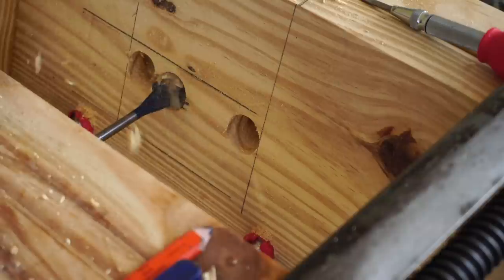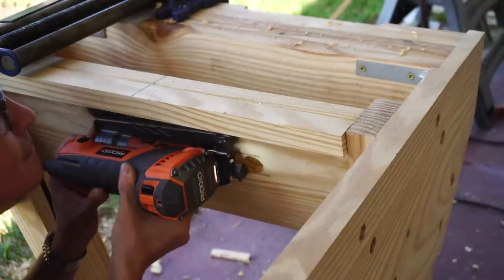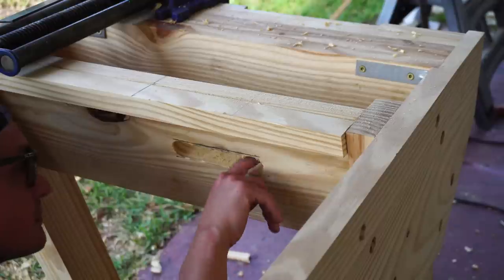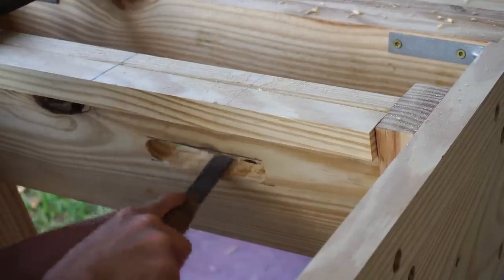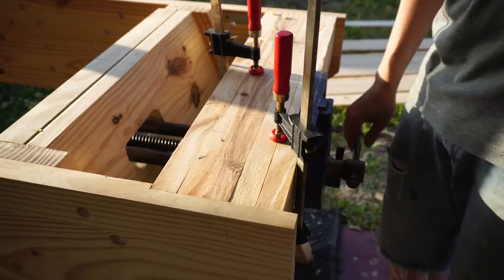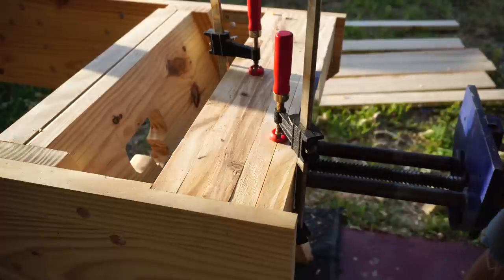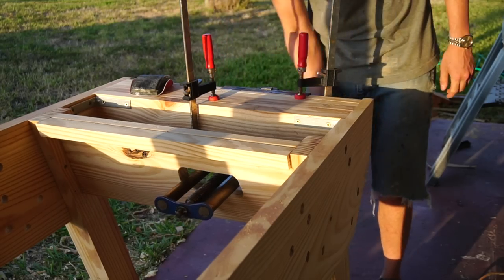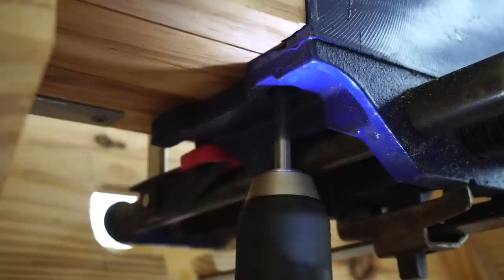Also, if you're making a longer bench, you probably won't have this problem at all, but since I'm Tiny Shop Guy, the 8-foot Nicholson from the book is actually compressed to 5 feet. So spade bits, a jigsaw, and a rasp got me to a point where the vise screw can fit the bench and slide effectively. Now I'm boring into the block for a through bolt to mount the vise from the bottom.